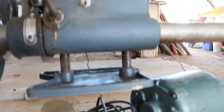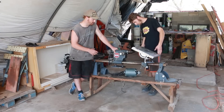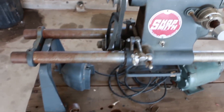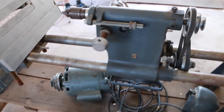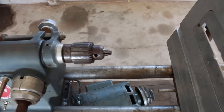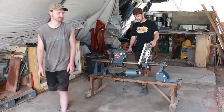The motor needs to be redone and probably re-hooked up to the bottom of this again. I'm going to start unseizing everything — this moves back and forth along with this, and this also slides on this rail. I'll be pulling this off and getting ready to do the slide system that controls our cross slide. This Shopsmith folds up into a drill press as well, so we're going to be trying to keep that, so we have both the lathe and the drill press. Let's get started.